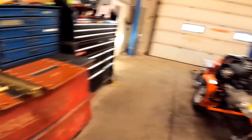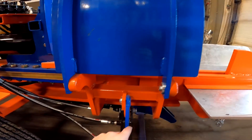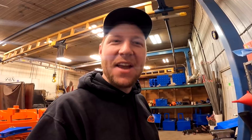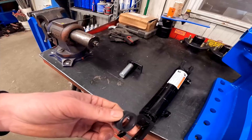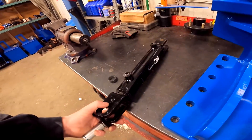The other wear components are in the pivots on the cylinders — they have a wear component there too. We use a plastic called Nylatron for those bushings. It's a really dense, hard plastic, and as it wears it self-lubricates, so you don't need to grease it. You can see how the pin goes in, and the bushing sits in there. The important part is that the pin is locked — there's a hole where you put a bolt in to keep that pin from moving.